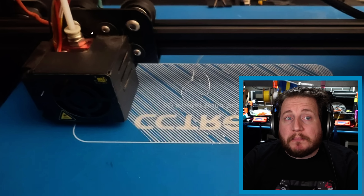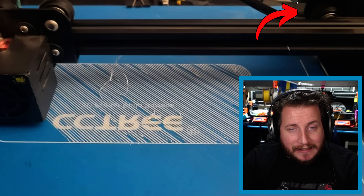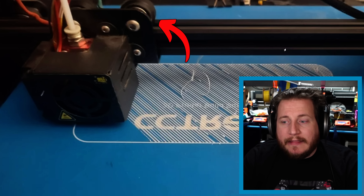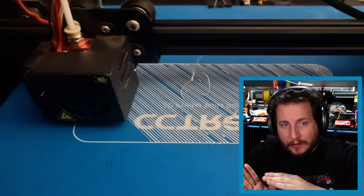The hot end is Bowden, meaning there's a tube going back to an extruder sitting behind the V-wheels on the Z-axis. Also check that your V-wheels are tight against the rail — no slippage. You don't want them so tight you can't physically move it, but it should resist sliding. If the carriage slides when you hold the wheels and push, go ahead and tighten the eccentric nut on the bottom side. That nut is oblong, so the V-wheel gets closer and then farther as you turn it.